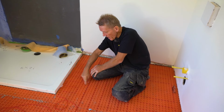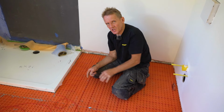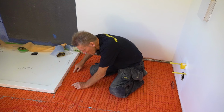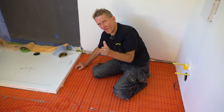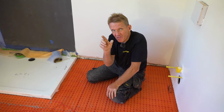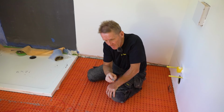Sorry. It's alright. So here, I've changed the way I've been running. Rather than going up and down, I've just done this little bit as a snake here. And the reason is because if I go up there, I go down there, I need to go back up there, and then I can't leave it far enough away to get my return run. In other words, it's coming closer than the minimum of 75 millimeters. These cables should never be closer than 75 millimeters.